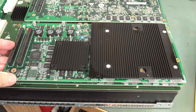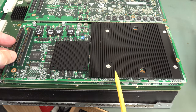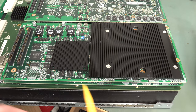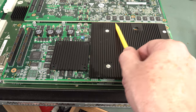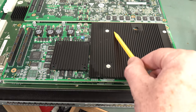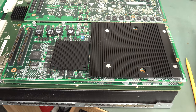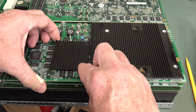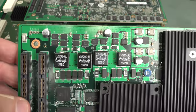Oh, look at that beastie. Wow, huge heat sinking under there. Once again, the orientation of the fins is very deliberate, because the airflow is coming in like this, and it's got to flow over those fins. Even though they're not very tall, so not a terribly efficient heat sink in terms of surface area, they've only got limited height, and they would have done all the thermal testing calculations to ensure it's correct, so they knew what they were doing. Wow, absolute beast. That one's just stuck down there, on an angle.